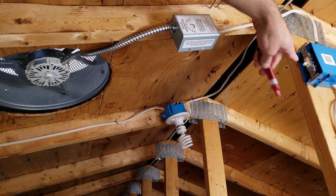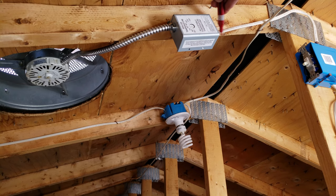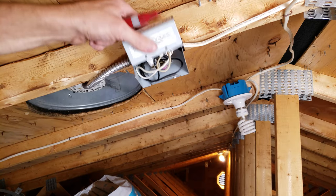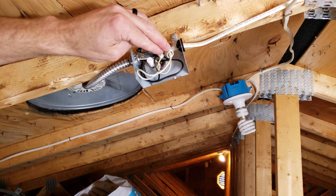Let's go ahead and turn it off. We don't normally have a switch this close — now we don't have power. We're going to take this cover off and measure for voltage at the wire nuts before we continue.